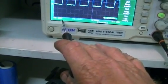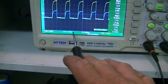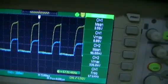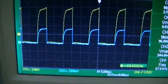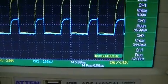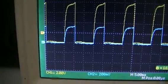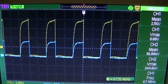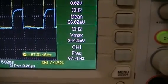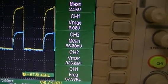My scope channel 1, the yellow channel, is across the globe and set at 2 volts per division. Channel 2, across our CVR, is set at 200 millivolts per division. I'm measuring using the mean voltage because I have a flat line along the bottom — this is a DC pulse system, there is no AC sine wave. So we can use the mean value of voltage and current. I've dropped both channels down one division to get the whole waveform in scope. At the moment our mean voltage across our globe is 2.56 volts, and our average current flowing through that globe — using our 1 ohm resistor — is 96 milliamps. That is fairly stable.